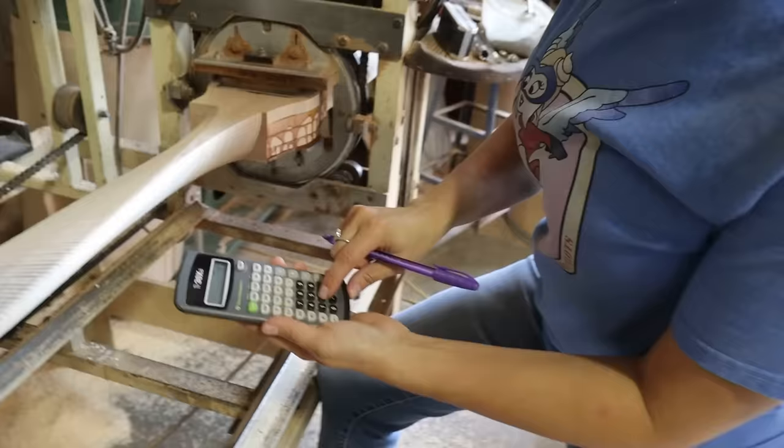So you put the heavy blade to the top, and then take your pencil down there. You mark your heavy side with an X. Now flip it around and do your sides again. Then you sand on it. And then you do this again, and then you sand on it, and then you do it again. You do it until you decide, I've got it, and it's a miracle, or I hate this thing, I'm definitely gonna cut it in half and put it in the fireplace.